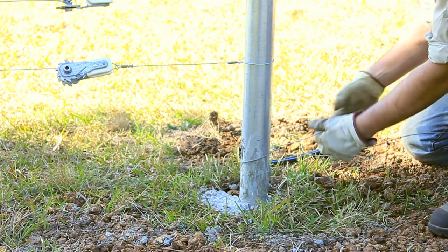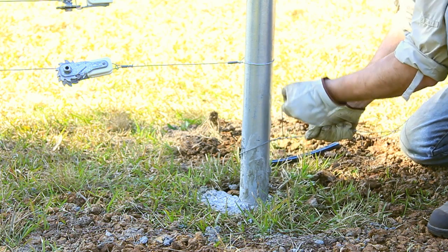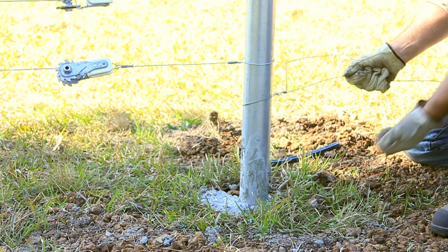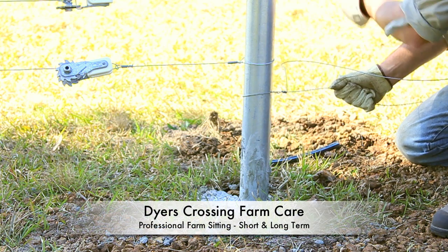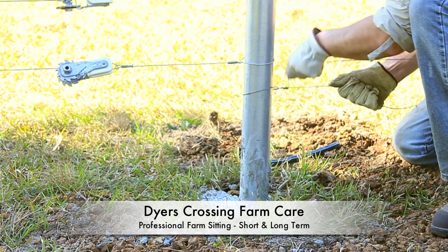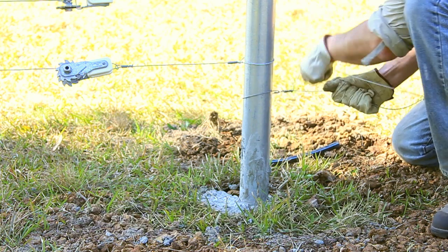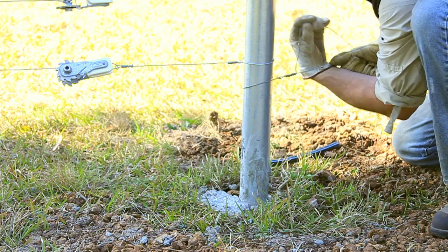The reason we want all this extra wire is because it gives us a good lever to go around. Just a little bit of muscle and a little bit of technique. Giving yourself probably four inches of handle out there is about enough, so that when you grab it — and this is where the gloves come in handy because the wire slides nice and easily in your hands — you're just pulling the wire not so much around but out. As you're pulling out, then you're going over. If you just try and go around, you won't end up with a nice tight knot, or a nice tight noose, as I'd call it. I like to go around roughly ten times. Usually you have to redo your handle about halfway. Just try and keep the coils nice and close together.